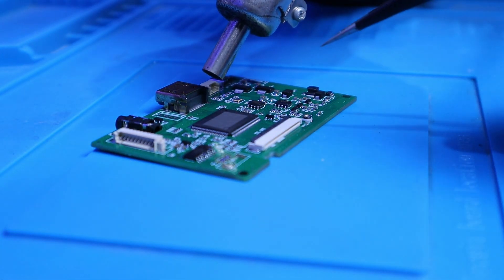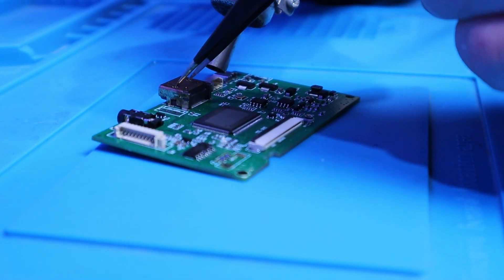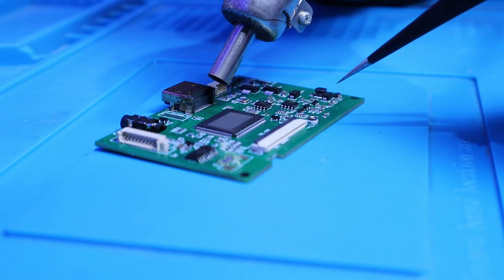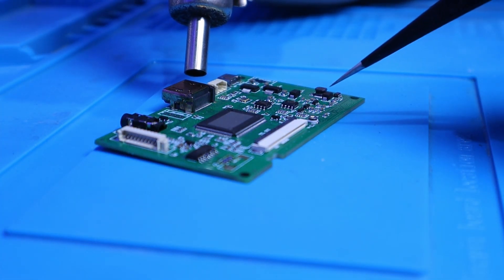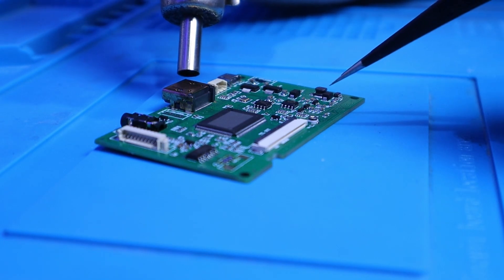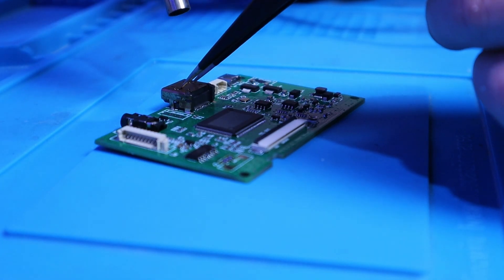Since I have a finished front housing and a working display driver, I decided to fit everything in and see if I can get it to boot. I removed the HDMI connector from the display driver, along with all the other unnecessary connectors, and held the PCB down with some Kapton tape to help ensure it doesn't make contact with the NUC at all. I also had to space the back cover up with a pair of washers, roughly 1mm, to clear the new display driver. I will update the model so this isn't an issue before I machine the back part of the housing or hand out any files for people to test.